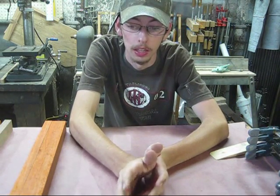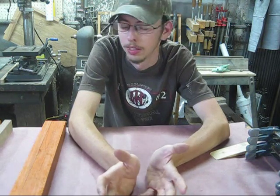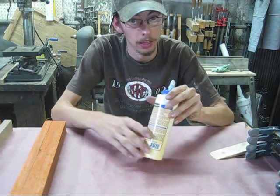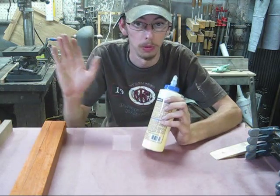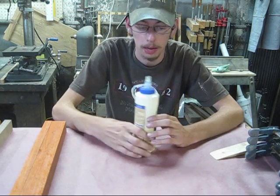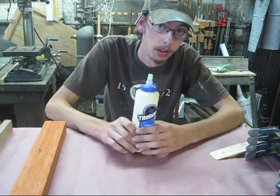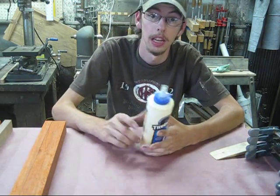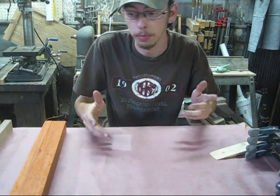One thing you need to take into consideration is when you glue up these boards, you need to think about the type of wood glue you're going to use. You need a wood glue that is waterproof and FDA certified safe. Since it's a cutting board and all the joints are going to be glued together, it's likely you're going to eat some of it, so you need something safe. No epoxies or anything like that. Type II is a good one — it's waterproof and FDA safe. Just read the back of the label to check those qualities.